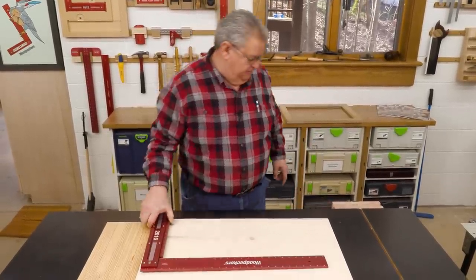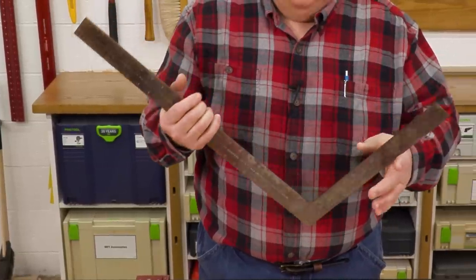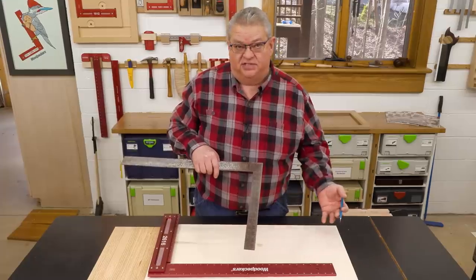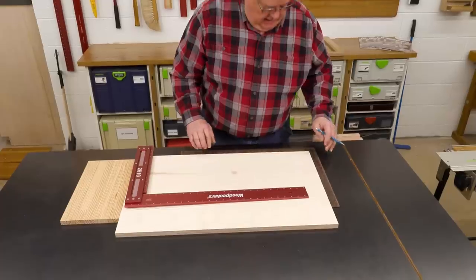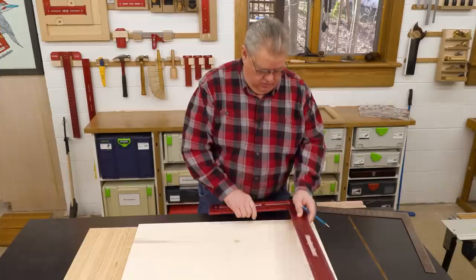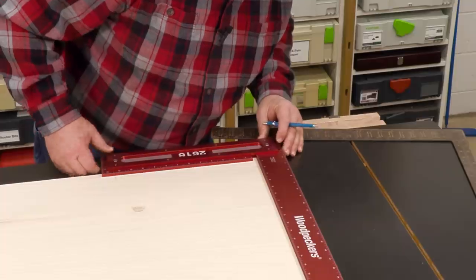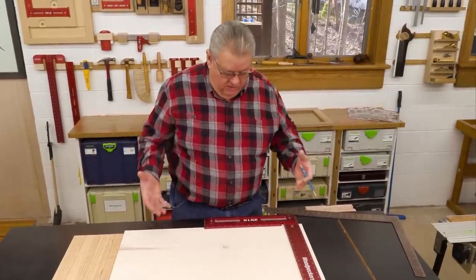Let me tell you what it's not — it is not a framing square. A framing square is a carpenter's tool with very specific purposes. One thing about a carpenter's square is that it's exactly an inch and a half wide, which makes laying out studs a lot simpler. But what a carpenter's square isn't very good at is working at the corner of something. That flat profile makes it hard to get on an edge compared to our large precision woodworking square, which rests on a piece perfectly so you can check the end or set it up for a mark without even having to hold on to it.